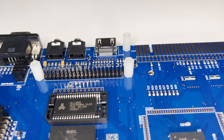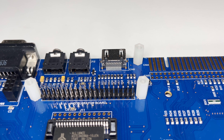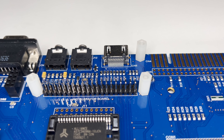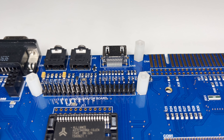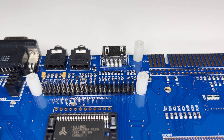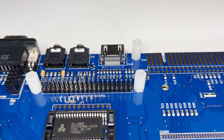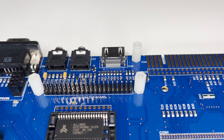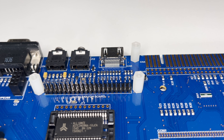That brings us to the next issue, and this is one of the biggies: HDMI. When a display detects an HDMI source, it has to terminate the HDMI signal lines in 3.3 volts. Displays are supposed to remove this termination when the HDMI source disappears, but some displays don't do that. On the Issue 2 boards, there is a DC path from the display's 3.3 volt termination through the signal lines and into the FPGA. This can act as a weak power supply to the board, so even when you remove the power there is some power getting through. This was termed back power, and many people have been advised that when rebooting their Next, if this happens, they need to remove both the power and the HDMI to get a proper switch off.